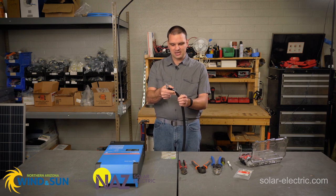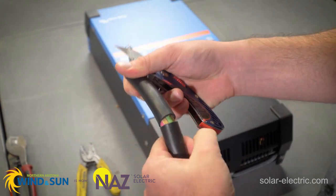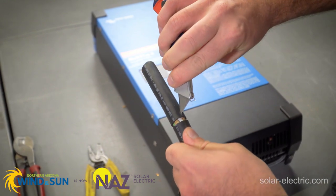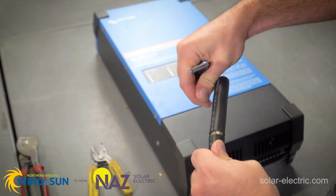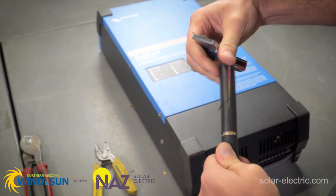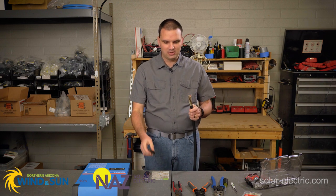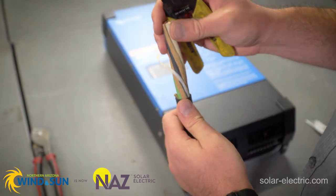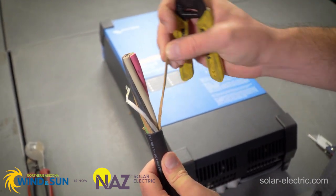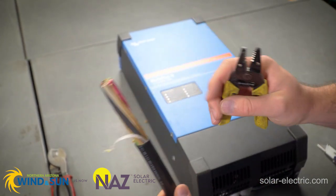Just be careful when you cut that we're not going to cut into the individual cables inside. We're using six gauge wire because this is for a 50 amp RV, and we need six gauge cable for 50 amps. You're going to be able to bend it a little bit and see the cables inside. Just be careful — we don't want to cut too far. Inside the cable, we have cardboard pieces that help fill the cable to make it round, and we're just going to cut those off because we don't need those.